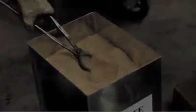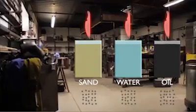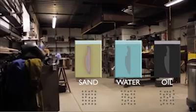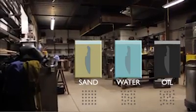The knife is placed in a bucket of sand to cool. It will cool at a much slower rate compared to room temperature or other methods, such as quenching it in water or oil. Newton's law of cooling states that the rate of change of the temperature of an object is proportional to the difference between its own temperature and the temperature of its surroundings. Air bubbles are trapped in between the grains of sand and insulate the heat radiating from the hot steel. Thus, it slows down the cooling process considerably.